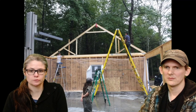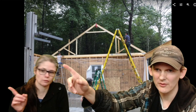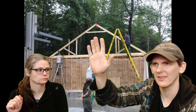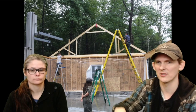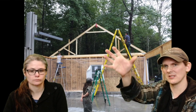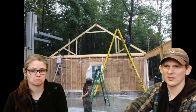So there we are. We got the first one in, so the cranker is out of the way. You see over here, we have some 2x4s, which we put up. The first one's the most dangerous, okay? When you're putting this thing up, there's nothing to hold it in place. So we had these 2x4s up, screwed into the back of the building. When we put this thing up, we just leaned it up against these 2x4s so that it would stay there while we're getting the next one. Because after these things are all in place, they hold each other together. But this first one is super sketchy.